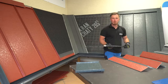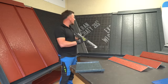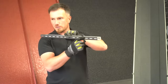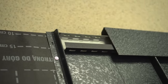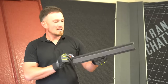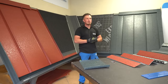For ridge flashings, apex flashings, and generally all flashings that go on top of the panels, we provide a flashing attachment box that can be cut to the widths of your panel. It provides a backing to screw the flashing to, while at the same time allowing ventilation. Attachment boxes ideally are fixed to the roof with two screws, while the flashings are fixed to the boxes with separate short coated screws to prevent penetration of the roof through the panels. Placing them carefully in the centre is vital for a neat and tidy finish. They can be temporarily fixed and sealed to the panels with double-sided tape or mastic if needed.